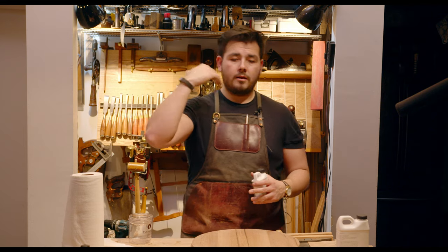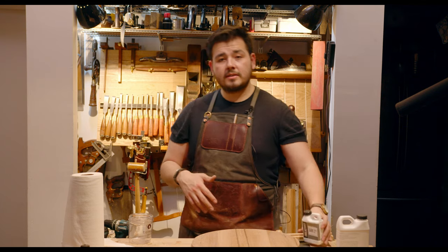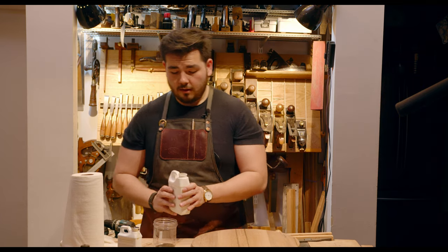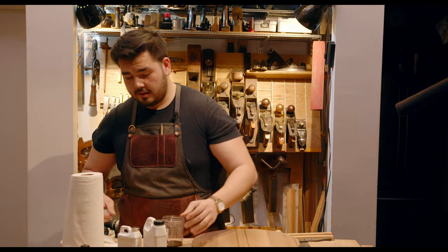With wax finishes, the abrasive pad shoves the wax into the pores of the wood creating a really nice connection. Now, one important thing to remember with pure tung oil, boiled linseed oil, and other oil-based products: there is the chance for spontaneous combustibility with your rags. Even if you use a white pad, make sure you hang that stuff up to dry before throwing it away. If you just chuck it in the trash it could create its own heat, set itself on fire, and you could have a trash fire. Let's keep it safe. I'm just going to thin the oil a little bit with some citrus solvent.